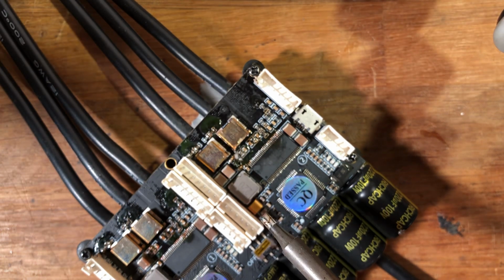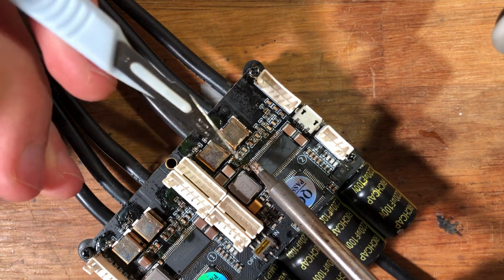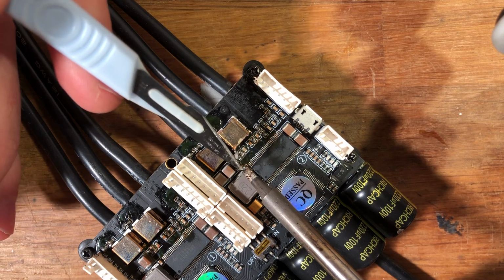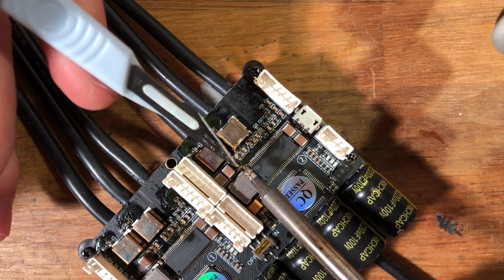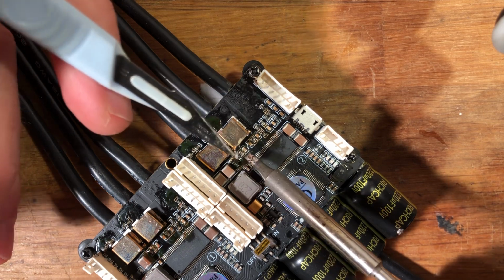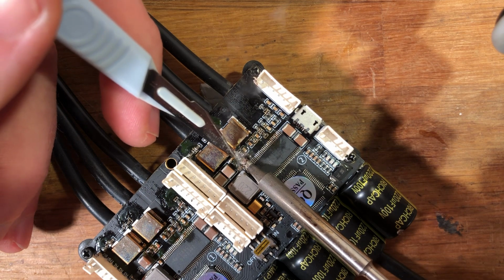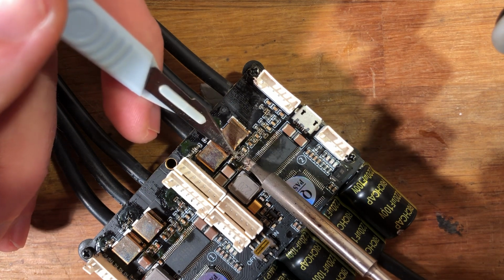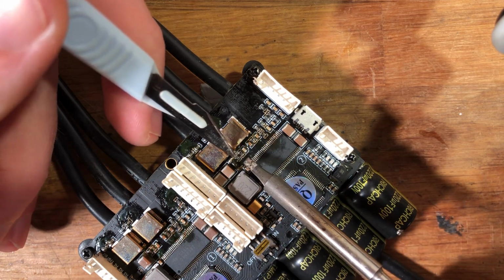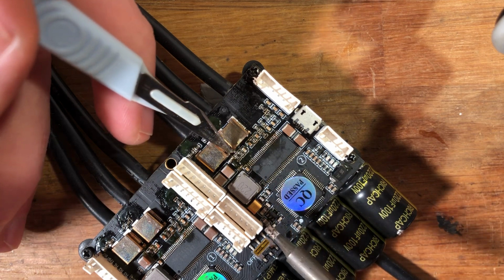Oh shit, it's not focusing. That's because I'm moving the tips. Oh, whatever. Yeah, so the resistor will kind of stick to the soldering iron, and we're using that to position it properly. So, pushing out that. And when I have it positioned correctly, I'm basically stabbing it with the X-Acto knife.